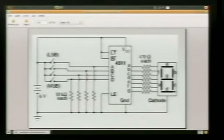Let's see, we've got our battery symbol that we've seen before. It tells us that the voltage is going up and around to the chip, and then it's coming back down through the ground and completing the circuit. But along the way, it's tied in here to these buttons. So in this case, if we push a button, it's going to allow that voltage to flow through and go to the chip. In the case of an Arduino, it'd just be us writing a high in the code, and it's going to pulse it out. So any number we want to make, it's going to pulse it through.